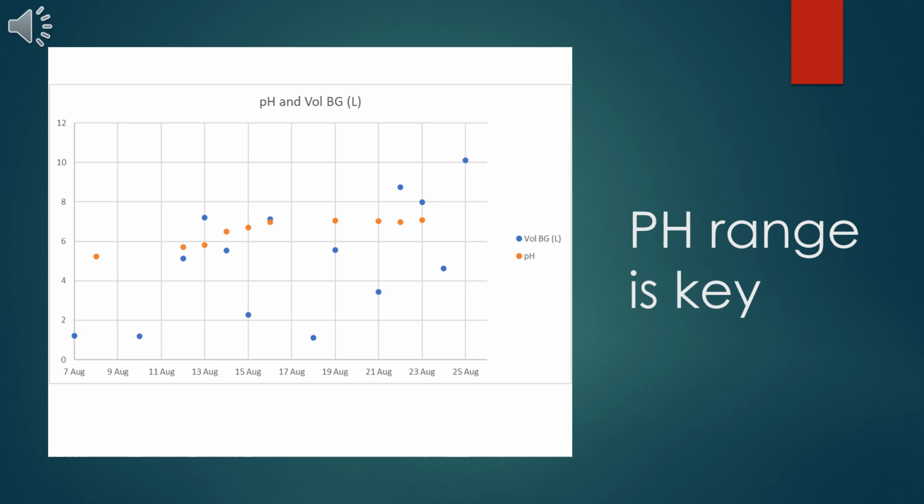We initially attempted to balance the pH using calcium carbonate, but it didn't provide the results we needed. After multiple attempts, we switched to sodium hydroxide, adding around 4 liters of sodium hydroxide solution of various strengths to bring the pH to a satisfactory level. It took significantly more base than we expected, highlighting just how resistant the system was to pH adjustments.